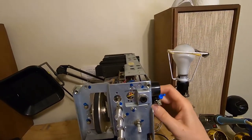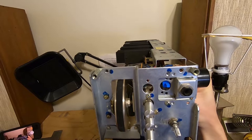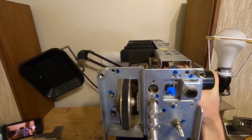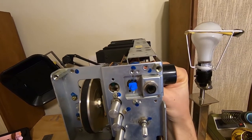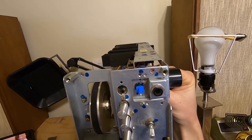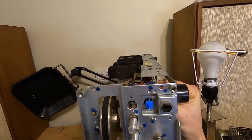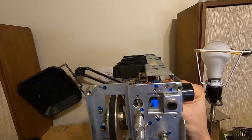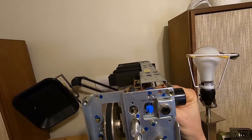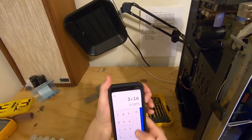Another thing that's really unfortunate is I tried installing this switch and then I realized the holes do not line up. So what I'm going to need to do is drill out the holes on the Marantz with a drill and a drill bit, so there will be enough clearance in the chassis holes to allow the switch screws to thread to the new switch. We'll start with 3/16ths.